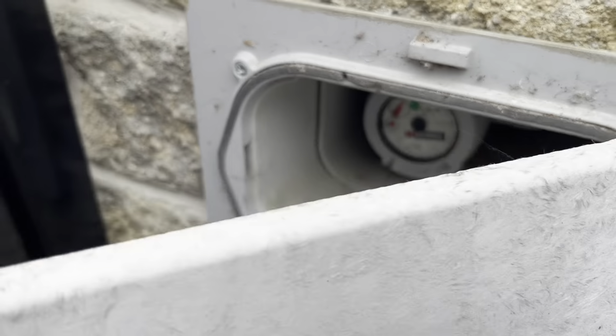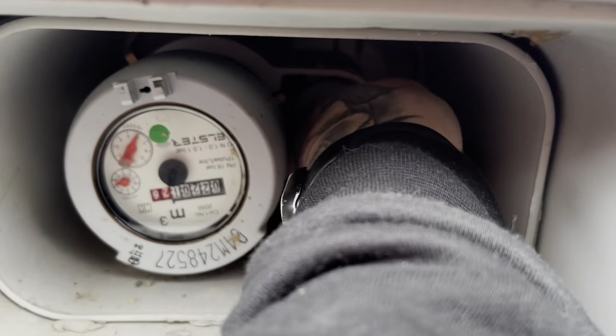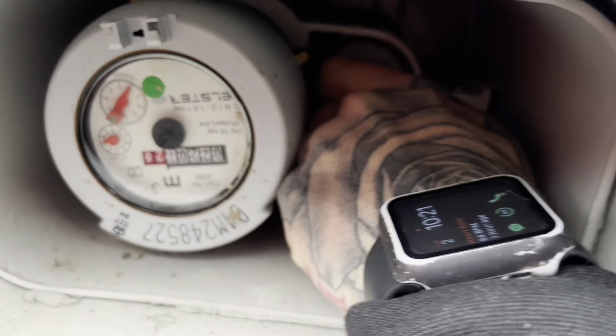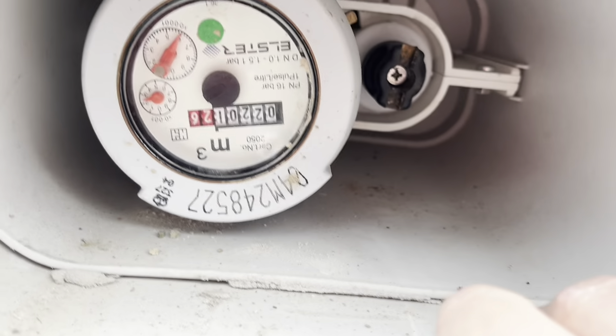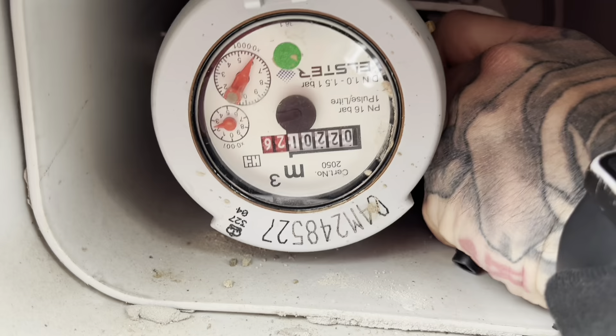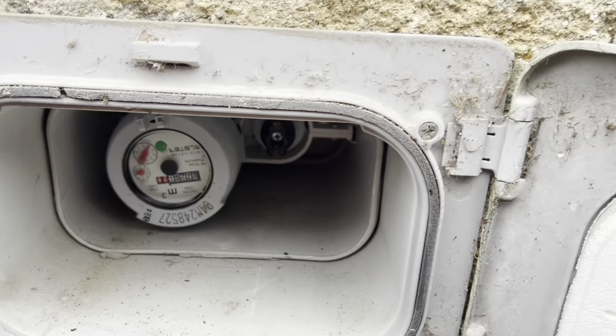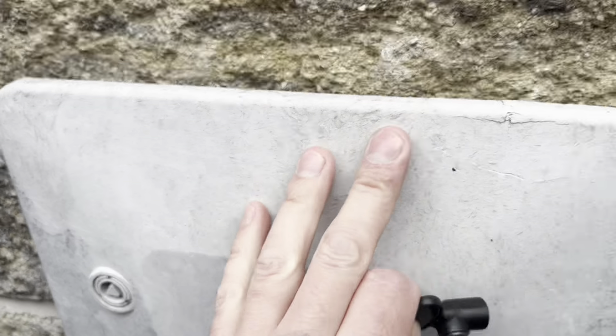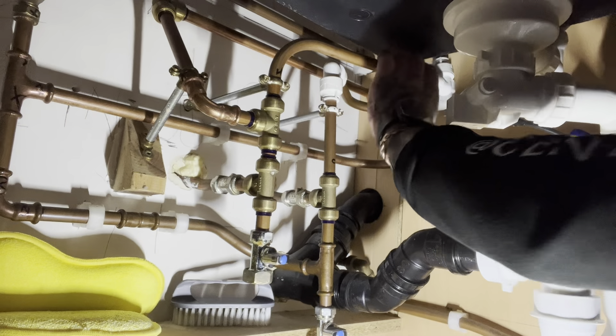There's also a style system with a cylinder. Kitchen sink tap to change and a leaking check valve to the outside tap. I'm trying to get some content for you. This is the stop tap for the house - they're not very common, but sometimes in new builds they are. So it's a quarter turn - when that's pointing up vertical, the water should be off. No actual stop tap in the house; you need a utilities box key to get in.